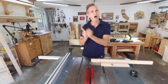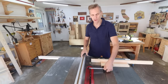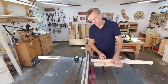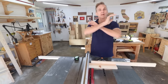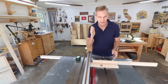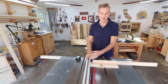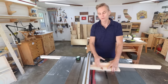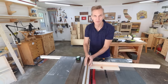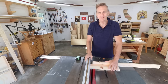If you're new to the table saw, you might have an idea — I could use my rip fence as a stop block, measure the size of board I need to cut, lock it down, and use that to make repeated cuts. Don't do this. One of the things you absolutely never want to do when making a cut all the way through a board is to use a miter gauge in combination with a rip fence. What can happen is that the cutoff piece gets trapped between the spinning blade and the rip fence, and it's just going to kick back, hit you, and cause a very bad day — you're probably going to spend the rest of the afternoon in the emergency room.